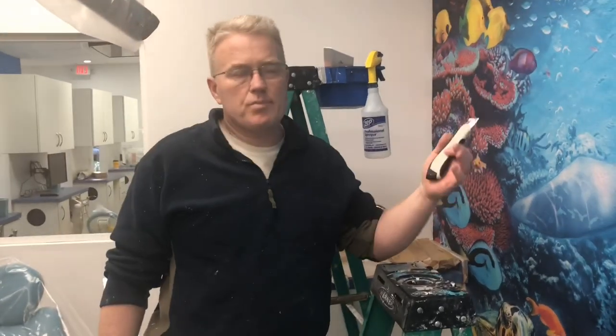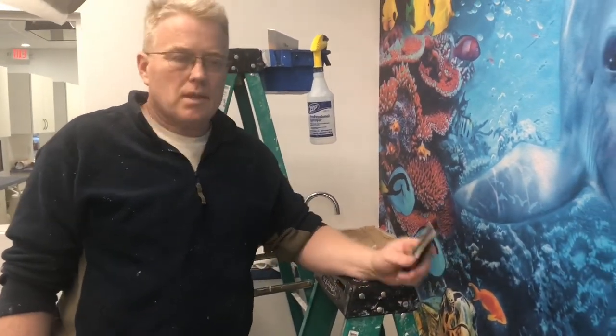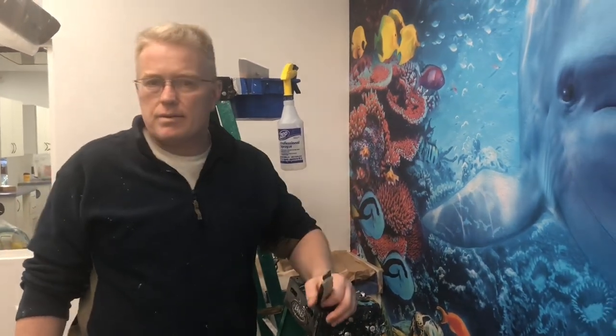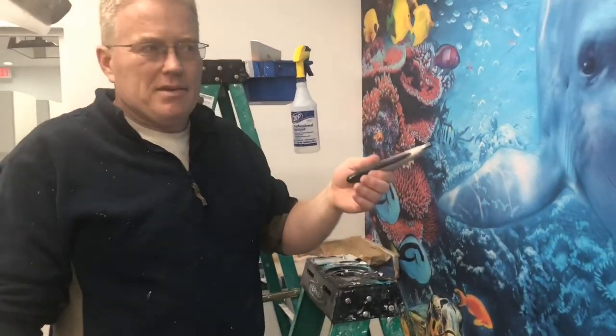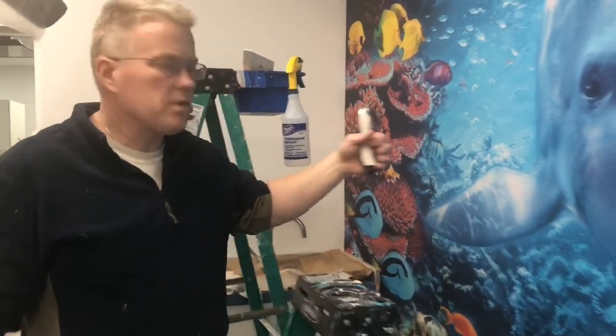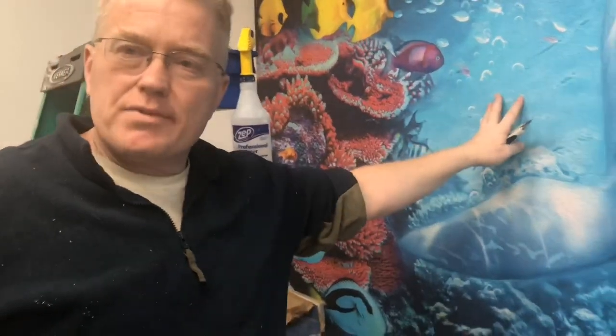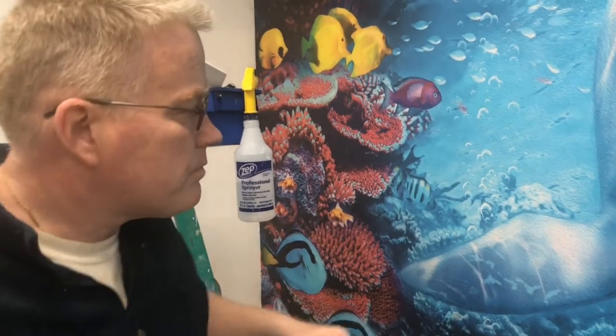So we're at the point where we're gonna double cut, right? Yeah, we figured we're gonna be. So I'm a left-handed person, so I'm hanging from my left to my right. And you do whatever is best for you. I'm a lefty, so my left sheet is always going to be under my right. It's the only way I can do it.